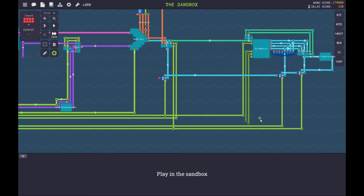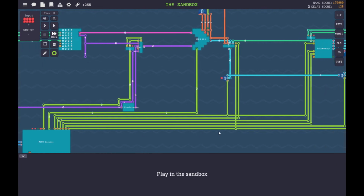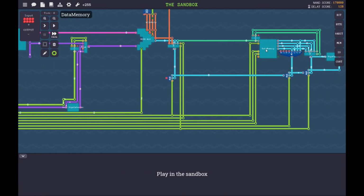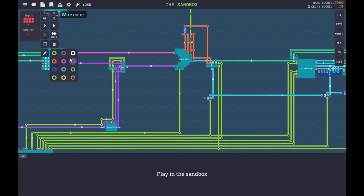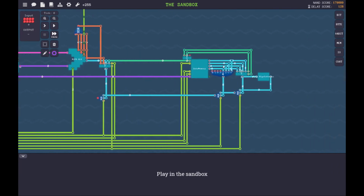All right, yeah, that looks right. Okay. And so these are two more signals that are just coming straight off the decoder. So you can bring these over here and connect them like that. And so now we have all the control signals to the data memory. The last thing is the value being stored over here. And if you look at the green sheet, you'll see that the value being stored is always the value coming off of the B read line of the register file. And so we can just connect that straight across. No fuss, no need to modify anything.